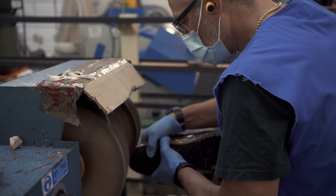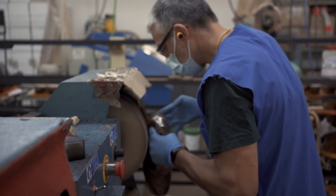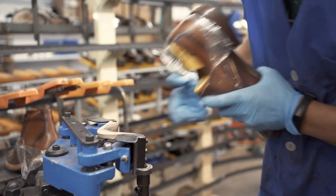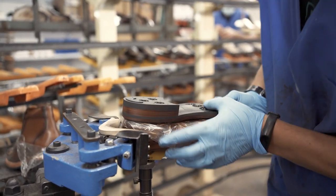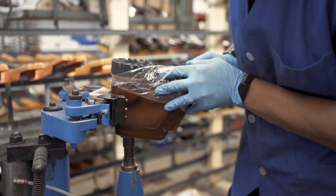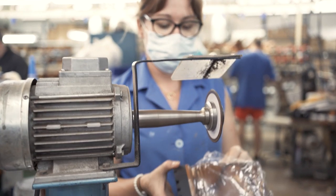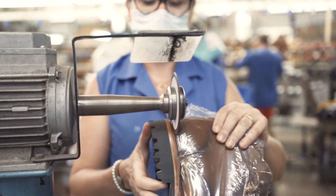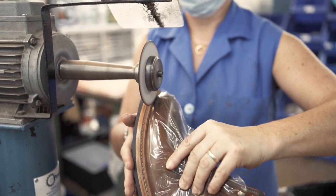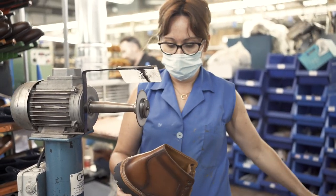This is Goodyear — he's buffing the edges of the sole and the heel, making sure they're nice and shiny. And this is probably one of the most significant points of shoe construction: taking out the last. The last has been in there for so long — this is kind of like the birth of the shoe. At this point you can call it a finished or nearly finished shoe. We'll take off the shrink wrap, and everything that follows is basically part of the finishing station — quality control and all the finishing details — and after that they'll be ready to be shipped.